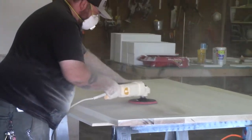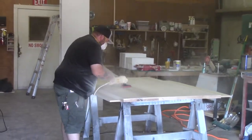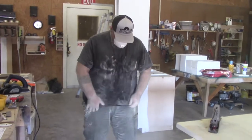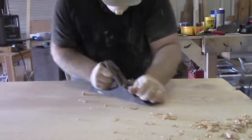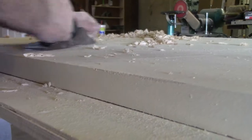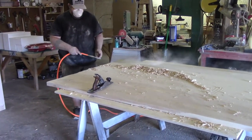I don't have a domino, so if I use biscuits it's a little bit easier, but a couple of boards were twisted pretty good so I just used this method — the angle grinder and my planer to take down all the high spots. I actually come back with 150 grit on the angle grinder too, to knock it down a little bit smoother after I use the planer.